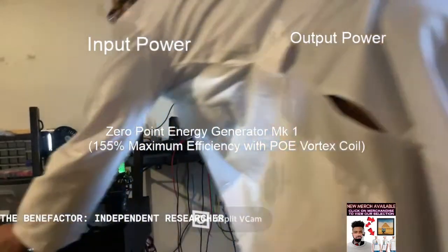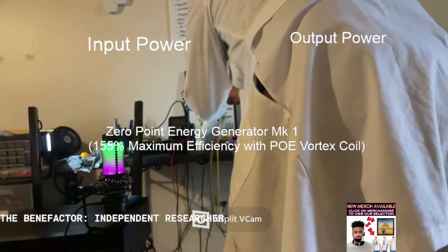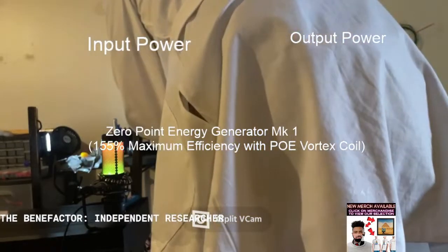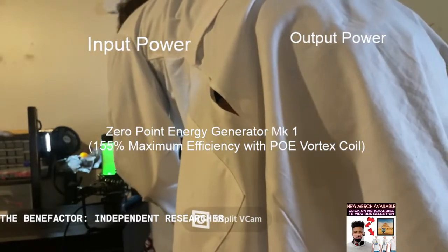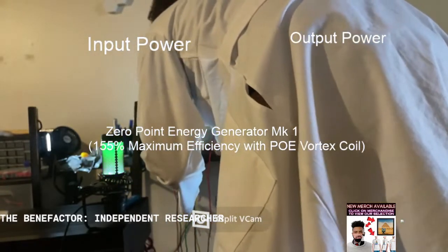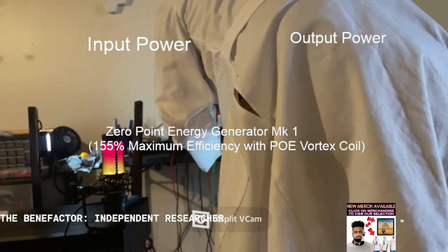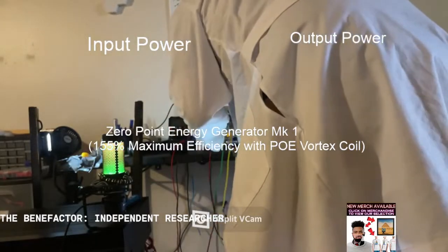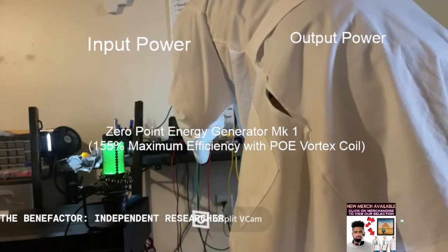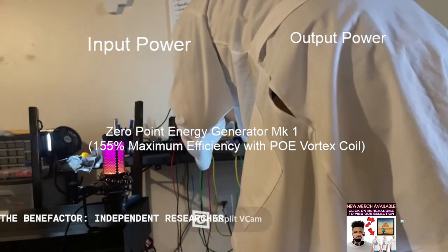Okay, so let's disconnect it again. We'll try the Nunez method again with it upside down. And again, we're not going to change the red lead. Red lead goes to the red output. Or technically it's the input. It's the start. Since it's flipped, it looks like it's the finish, but it's actually the start. Don't let that fool you. And the output, the finish of channel A, is going to be the positive of the load, which is yellow. So the finish of channel A, the black wire, is going to be hooked up to the yellow.